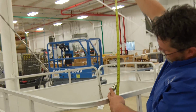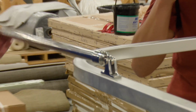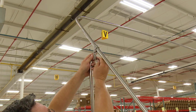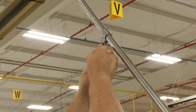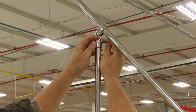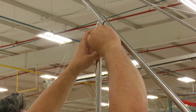And so we're right at our 31 inches. We cut one of the rigid support struts to 31 inches. Rigid support struts are provided by Sailrite at 36 inches. So we cut off 5 inches. Now we will attach that tubing to the 2 eye ends and tighten down the set screws. The rigid support strut kits come with 2 support struts. We'll attach one to the starboard and one to the port side.